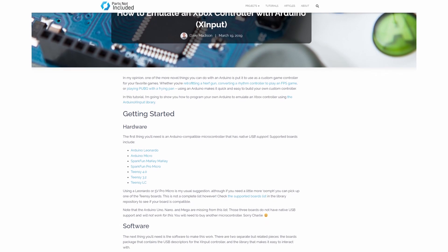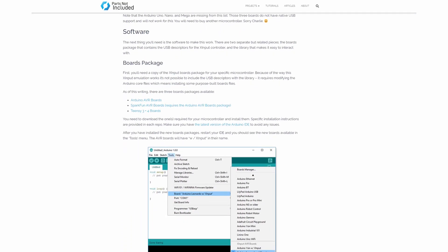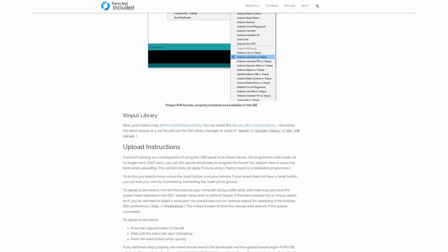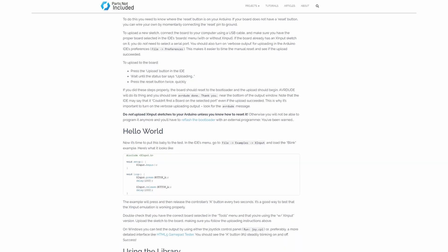This library is probably a little more difficult for beginners than the standard joystick library, as part of the process of supporting XInput prevents the Arduino from being able to reset itself during upload. This means you'll need to press the reset button on the Arduino at precisely the right time during the upload process, otherwise it will fail. Dave Madison, the creator of this library, has a fantastic step-by-step tutorial on how to use it, and he's included a debug mode so you can still do development work on your computer before finally enabling XInput. I'll leave a link to his tutorial in the description if you want to check it out.